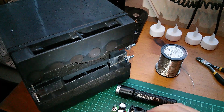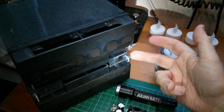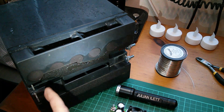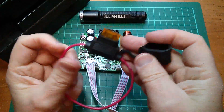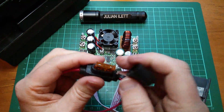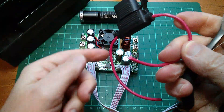If I'm going to drive a lot of current through this thing, I need a fairly substantial input supply, so I've got two 12 volt gel lead acid batteries. I've put a thin piece of wire to act as a fuse, but I might run a separate fuse from the positive down to the supply. I found a fused connector with a 5 amp fuse in it — that might be enough: 24 volts in, 12 volts out, 15 amps. I'll probably need more like 7 and a half amps so I may uprate that, but for the moment that'll do. Let's wire it from the battery to the input.